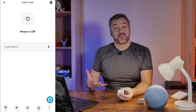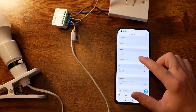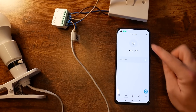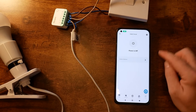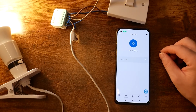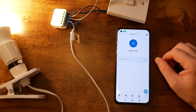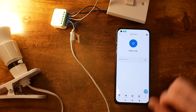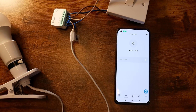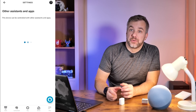My first test was to see the latency between the Alexa device and the Sonoff Matter-enabled device, and it was pretty good actually. All the actions — whether I was toggling my lights using the physical switch connected to the Sonoff Mini R4M, using the actual button on the relay itself, or using the app to toggle lights on and off — were quite instant and everything worked as expected. The updates from physical switching went instantly back to my app, and I was quite happy with it.